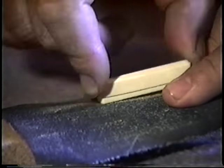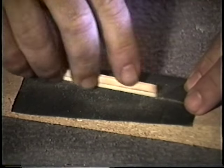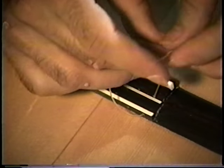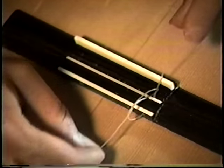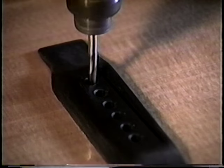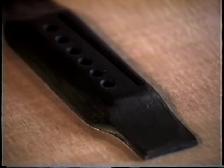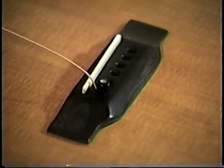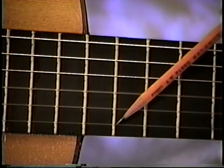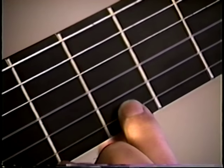The nut was ground down to within a sixteenth of an inch of the line and tapered back about 10 degrees. We rounded the saddle into shape, tapering back the top bearing surface to prevent string buzzing, but left it taller than necessary until the playing action was adjusted. With nut and saddle in position, the two E strings were attached first — on the classical bridge, ends are tied in place. Before stringing the steel string, the bridge holes were drilled out with a reamer for a tight pin fit. Slots for the strings were made with a coping saw blade. Measuring from the edge of the nut, we marked positions for the first and sixth strings, noting the classical design requires slightly more space near the high E string to prevent it slipping off under low nylon string tension.